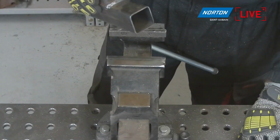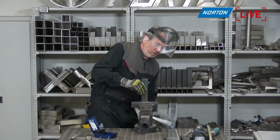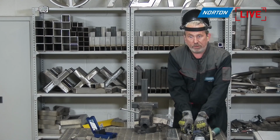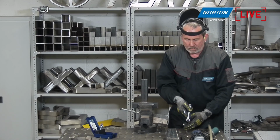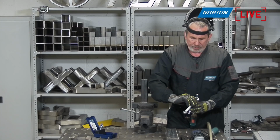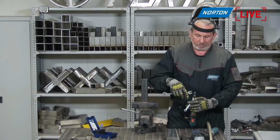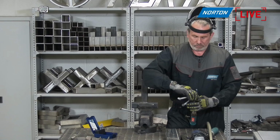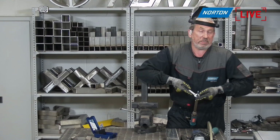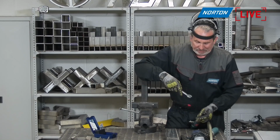So we'll just show you a quick example of how that's done. I'll just get this in the vise, and I'll change over the burr. Bear with me. That's tightened up. Okay, let's get this ball nose cylinder inside the machine. It's a bit cumbersome changing over these products. It's not so easy with the two spanners that you've got to use, but as Paco said, they last a long time, so this kind of downtime with changing these tools over is very limited, to be honest with you. I wouldn't be too concerned. When we tighten that up, all we need is a little nip on there, because the direction it runs in is self-tightening. If we do it up too hard, it's going to make it really difficult for us to take off later on.